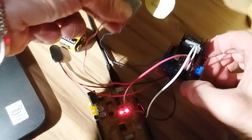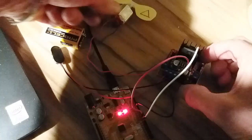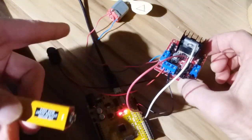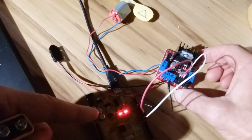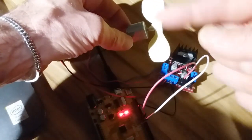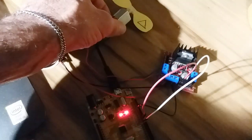The key to driving DC motors from the Arduino is to use an external power source. I'm driving the motor via the H-Bridge with a 9-volt battery and powering up my Arduino Uno with 5-volt micro USB. I noticed just using the 5-volt going into the Arduino and also driving the H-Bridge module, that this 3-6-volt DC motor would sometimes spin for a few seconds, but mostly it would cut out — there's too much of a voltage drop.